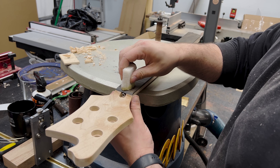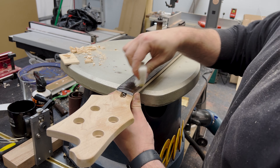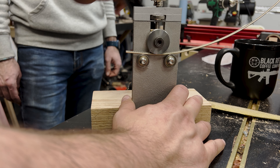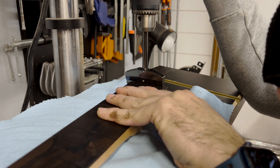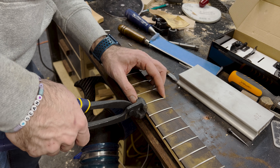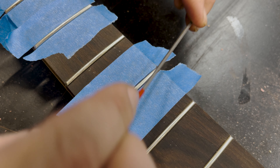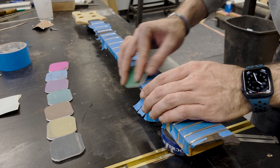The neck was finally oiled up before knocking out the fretwork — I was a bit sad with how dark it made the zircote, but it still turned out nice. When bending fret wire, I learned it's useful to bend it slightly tighter than the radius of the fretboard. Sean cut the frets to approximate size, keeping them organized to save materials. Using the drill press attachment, the frets were pressed in — while Sean simultaneously cracked my cast iron table. Once the frets were set, they were flush trimmed with a modified end cutter, then filed down flush to the edge of the neck. Sean spent about six hours filing and polishing each and every fret until it was as smooth and shiny as possible.